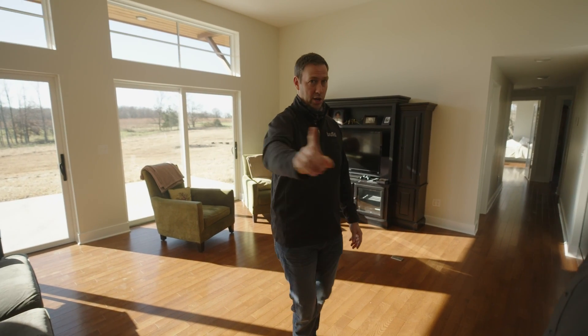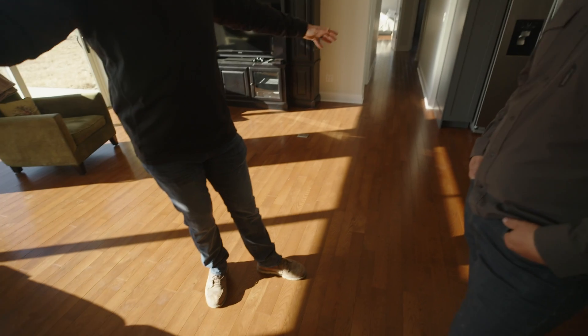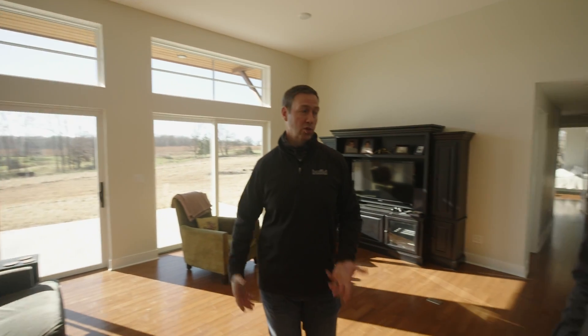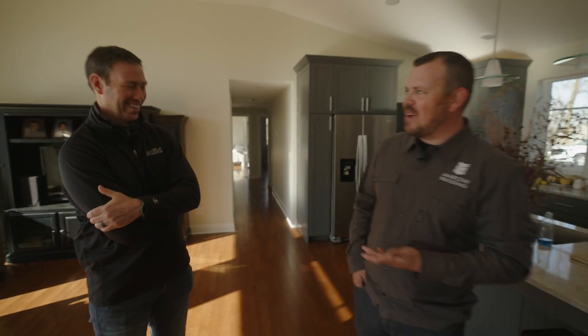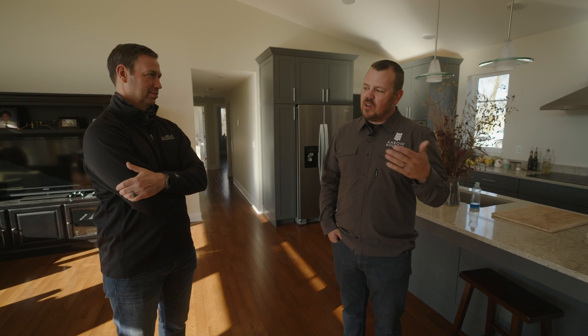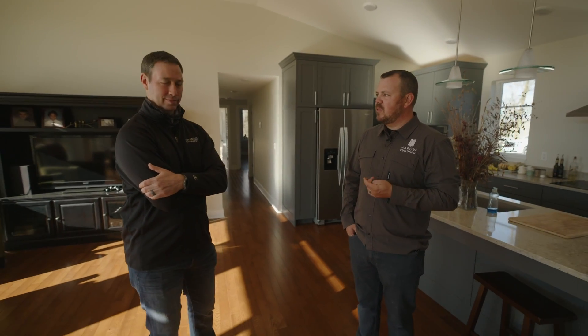This is 2,600 square feet on one level — a big ranch house. That perimeter stem wall was probably no more than 20 to 30 yards of concrete. Had you poured a continuous slab on a 2,600 square foot house in Texas, you'd be looking at 60 to 80 yards. So you potentially saved 40 to 50 yards — an environmental benefit and a benefit to the client's pocketbook. The first time we did it we didn't save a ton because of the learning curve and labor, but now we have a really good grasp on execution, and it's not a bad way to build at all.